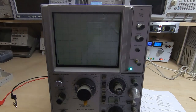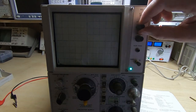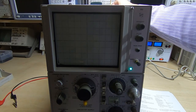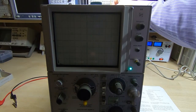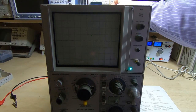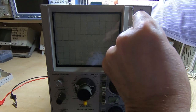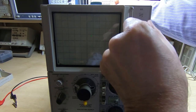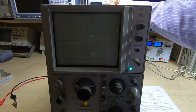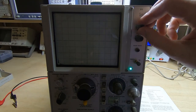This is a bit of an odd adjustment. I'll move the light out of the way so we can see the dot on the screen more easily. The first thing I have to do is make sure the intensity is turned all the way down, then adjust the pot in the high voltage supply until a spot just appears. We're getting a spot just starting to appear there. Next, we adjust the intensity control just beyond the point where the spot starts to brighten, go one division past that, then turn the adjuster back until the spot just disappears.